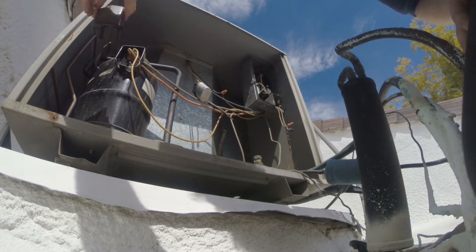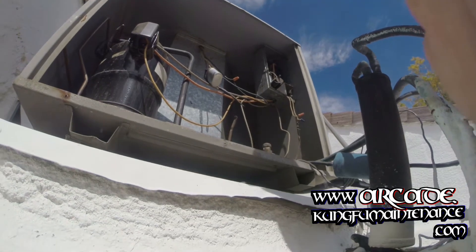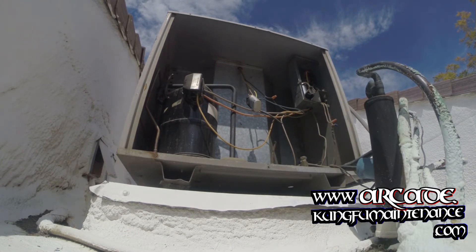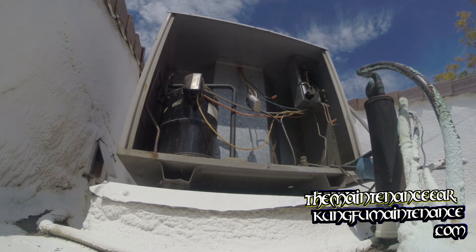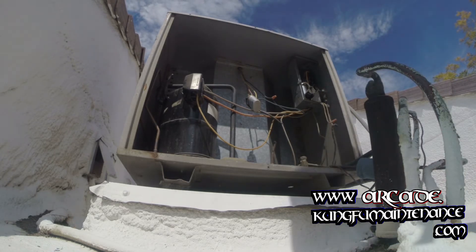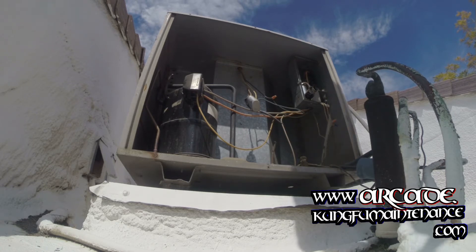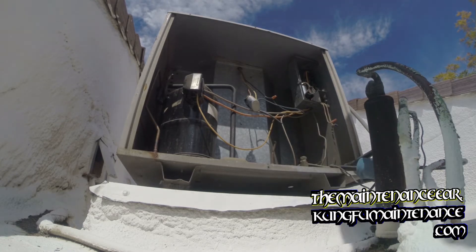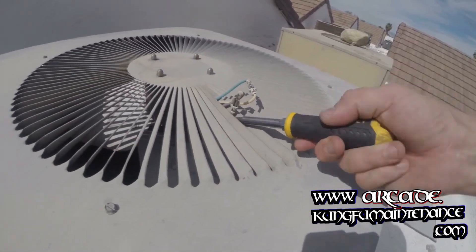I've got someone with no AC at the moment, so that's going to be first priority — getting them AC. I can come back later and anchor that capacitor. I don't see any other wiring shorts or anything, so I think that's what we've got going on. Just got to get my new fuses here and change them out. Looking at the top, we've got the wiring going through the lid here.